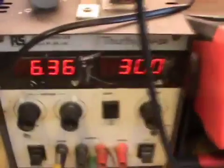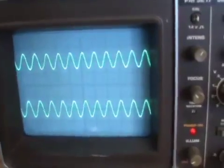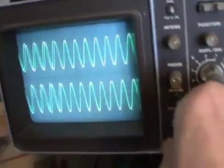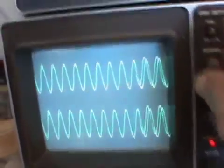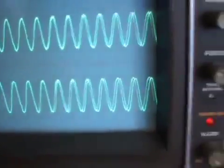Right, I'm going to drop the mains off. The heater supply and HT from the mains is now off, but because the heater is running independently on DC you can clearly see the heater is still rolling. This scope is coupled up to the preamp's output. When I give it some AF you can clearly see — even in the sunlight, sorry about that — you can clearly see that it is amplified.